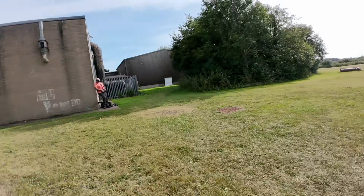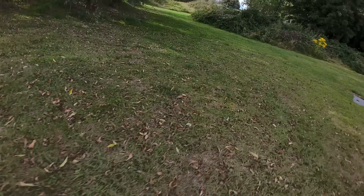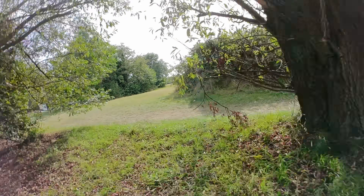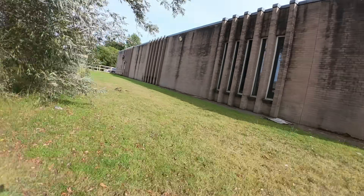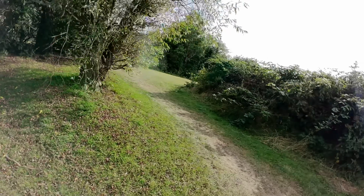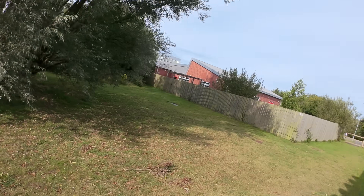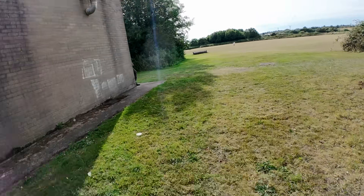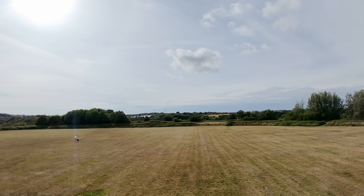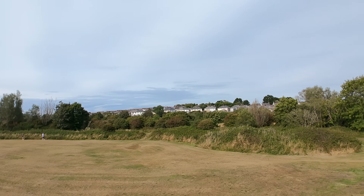In 16x9 mode there are no visible signs of vignetting, and overall the image quality looks really quite nice — from a recorded DVR perspective it does a fairly decent job. Although you are going to notice more lens flare than you're used to getting with the O4 lens on its own, and this may be a problem if you're trying to record footage. It's not just the flare — you will also get spots appear on the lens because we have a second piece of glass in front of the main lens.